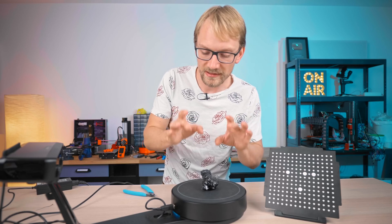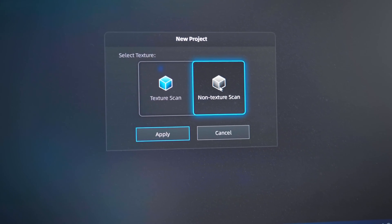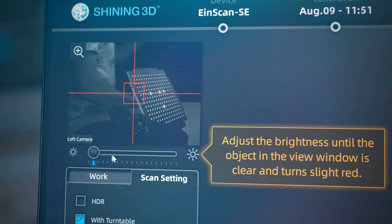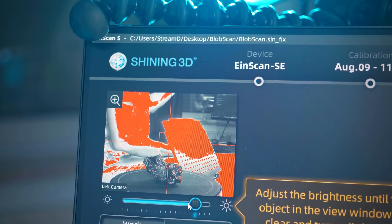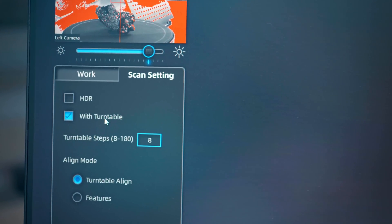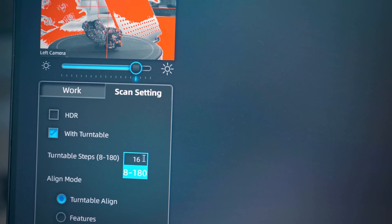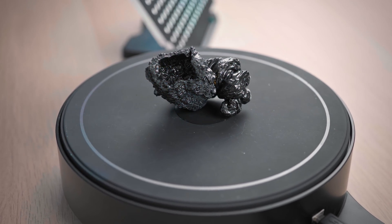During a scan, the part needs to be resting flat and can't shake around. It's all black — you can see it is literally not picking up any texture at all, but we can adjust this. Anything that's red is overexposed. If you go to about here, it should be okay — not much of the part is actually clipping into the whites. We're gonna use the turntable so it auto-rotates between scanning positions. We'll tell it to do 16 scanning steps — you can bump this up if you have really deep crevices you'd only see at one angle.